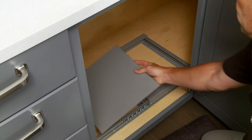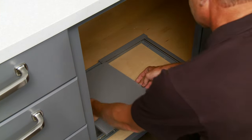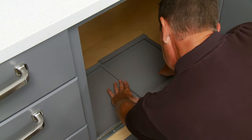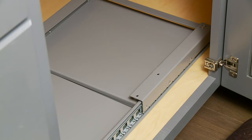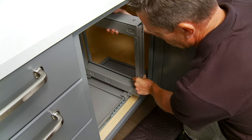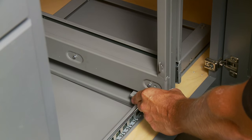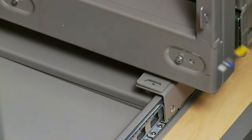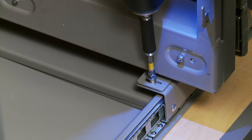Now place the covers on the base. Place the upright slide divider on the base, lining up the mounting holes, and lightly secure with 4 number 6x7/16 flathead machine screws. After all 4 screws have been installed, make sure the unit is square and firmly tighten all screws.